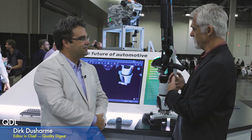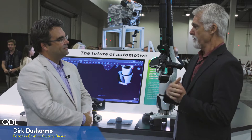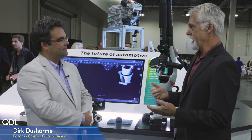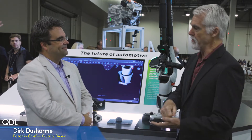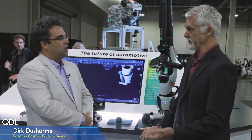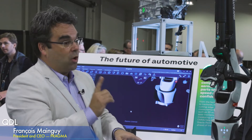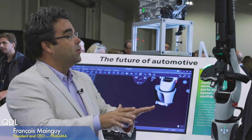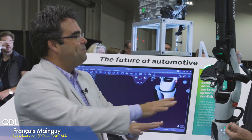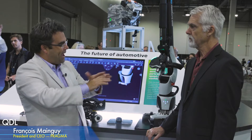Here's what happens — and I want to repeat this because I thought it was the interesting part. You take a laser scanner and fully scan the part. Now you've got your dimensional data in the software. You go back, replace the scanner with the NDT sensor, and it's aligned. You do that same scan with the NDT and it overlays on top of your part mesh — you see exactly where that fault is. It's perfectly registered in 3D space. There's no manual fiddling, and moreover it removes the need for manual stitching of all the passes you would make on a typical C-scan machine. You have the freedom to go where you want to scan, and everything gets mapped where it should be on the 3D part.